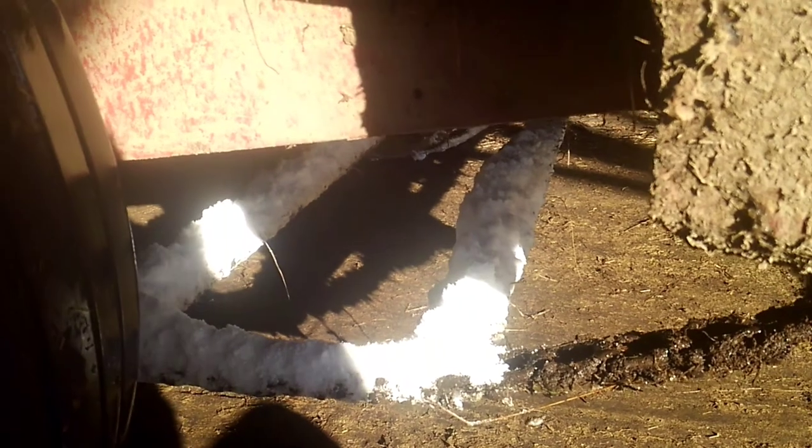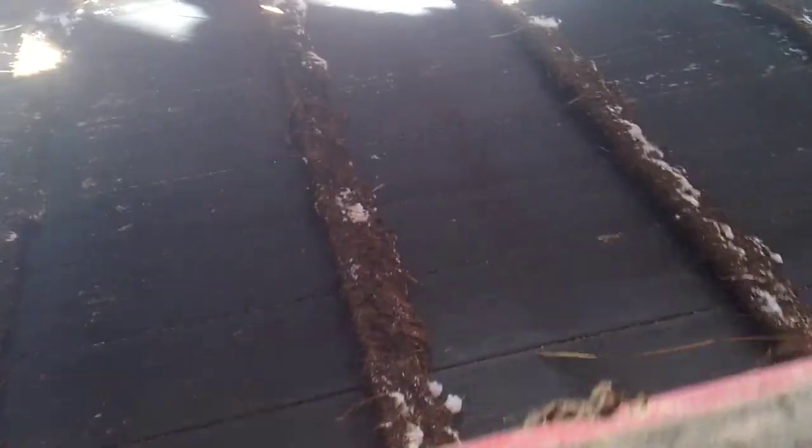And the problem is, see how low it's hanging below here? That should be up within 2 inches of the bottom of the spreader when it's adjusted properly. And I've taken anywhere between 6 and 8 links out of this chain already, so it's getting pretty stretched. And last winter when I cleaned the spreader out, I scraped these off. A lot of these had some flex in them. I'm surprised I haven't broke one here yet.